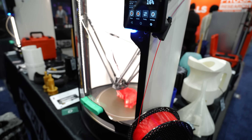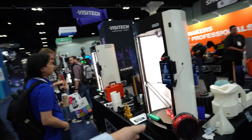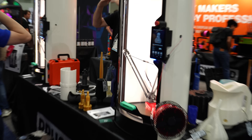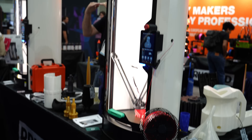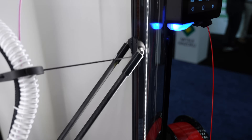One thing I like about this printer: every printer I get in for review I do decibel testing. Some are literally as loud as a jetliner — 70 plus decibels. This one, I can't hear it at all. You can get right up next to it and it's barely making any noise. Was that a design requirement? The ultimate design goal is so that every engineer can have the printer on their desk. There are many details we had to focus on — one is getting the drivers right so we get as little motor noise as possible. The other has to do a lot with cooling.